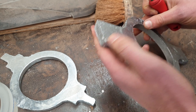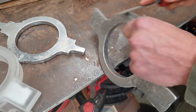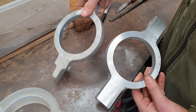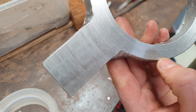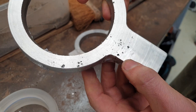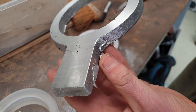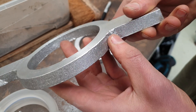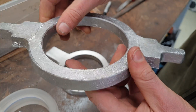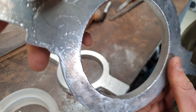It's a question of filing off some bits like that — that sort of edge there. In terms of the finish here, I'm not actually sure which I prefer. After turning it on the lathe, this is what we've got, and it looks great there, but then if you've got any little voids — which unfortunately this one has — then it shows up a lot compared to this, which doesn't seem to have any of those same kind of amount of voids to it.